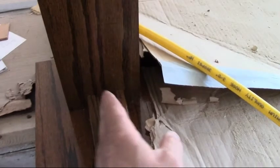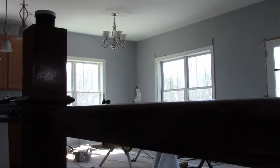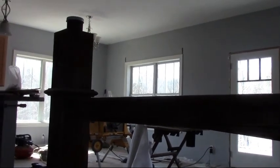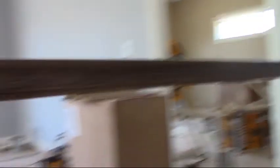I would say we have to fasten that — that would be a good thing to do. It's got to be straight up and down. So I'm going to get a level and make sure it's straight up and down from the center of this newel post. Handrail height, by the way, has to be a minimum of 36 inches for residential. For commercial, I think it might be 42 inches — so if you go to the mall or a business, 42 inches, but 36 inches is the minimum. Otherwise, little babies might fall over the edge. And remember: four-inch spacing on our spindles.